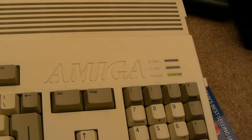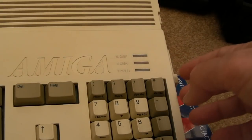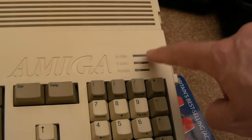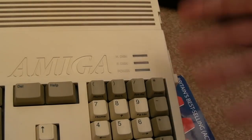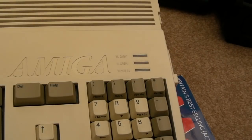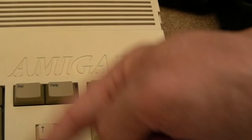Yeah, there's something wrong. Now, it's strange, but I had exactly the same issue there. You saw what was happening. I was getting no video. The screen just went blue as if there was no video, and the LED went off there. I tried that a few times, the same thing. I just reseated the card, pushed it as far in as I could, and then it was all right. So I think it's all about my slot.